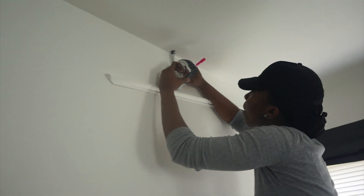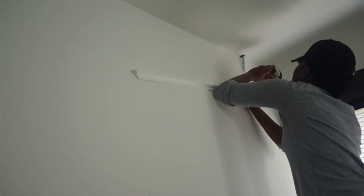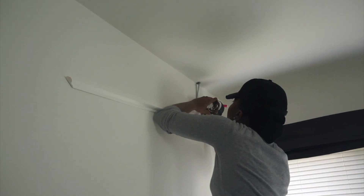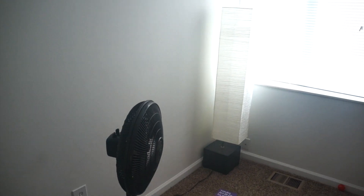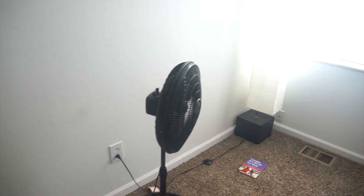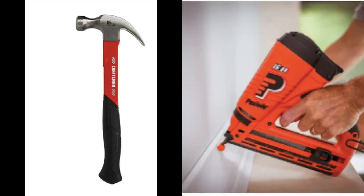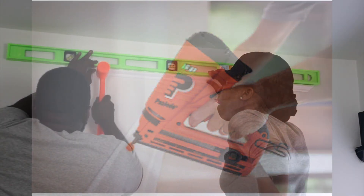I am not a regular Jane and I do not own any power tools — I don't have a nail gun — so I'll be going old school with my hammer and nails. Also, this is a rental property, so I want the least amount to zero damage on the wall in order not to lose my security deposit. This is why I'm using brad nails as opposed to finish nails, and also why I'm using a hammer instead of a nail gun.